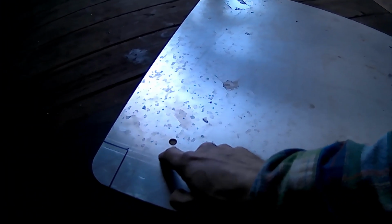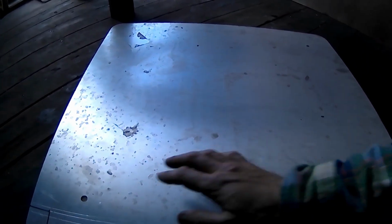I'm going to fold this end up, and then I'm going to fold this end up. And then I'm going to take off the back plate there. I'm going to put a flat bar of steel to clamp this to the deck, and then I'm going to fold this end up this way, which will give me my box. So this should be good, and that'll leave the other end open. And a 24-inch pan, almost a 3-inch thick wall, 2 3/4, and yeah, hopefully that goes well for a fellow.